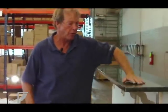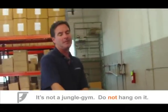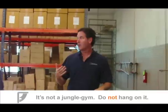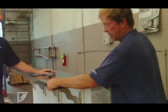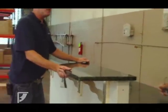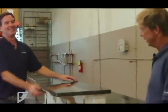The caulk is really the only reason — if somebody bumps against the granite, it keeps it from being able to shift. You don't caulk it for structural support because the bracket takes care of all that. You've got no problem with that piece of granite wanting to move — kids can hang on it, though we wouldn't recommend it. It's better than those wood corbels that don't hold anything — they're more for looks. In an application like this, if you don't have a strong bracket, the granite could tip on you.